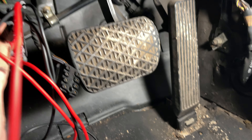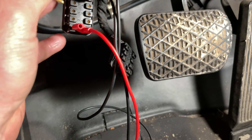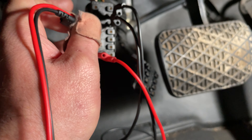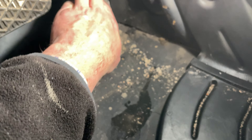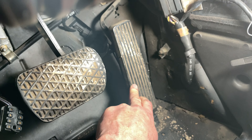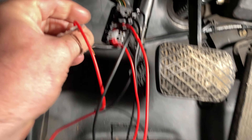Clutch and motor activate first — and I'm going too far here, this is basically actuating my kickdown switch. So this system has to be capable of delivering two and a half amps to activate the kickdown solenoid, and then I release it.